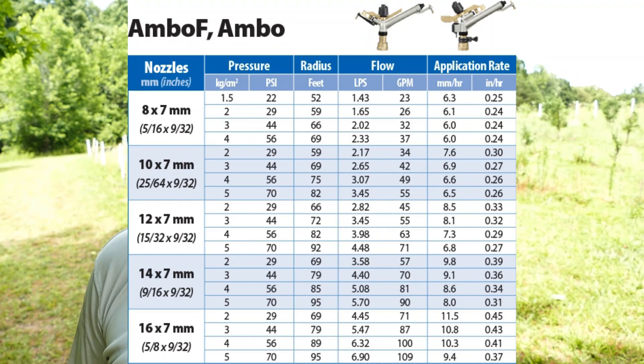I know somebody asked what kind of sprinkler head that was — I'll drop a link in this video's description. I think the company is Ambo, or maybe it's Syme and Ambo is the model. Anyway, it's a full circle sprinkler, inch and a half, and it comes with a couple different nozzles. There are a few different suppliers out there, but I ordered mine through Amazon and it actually shipped from Irrigation King, which has their own website. The pricing is pretty much the same no matter where you order. Looking at the specs published for this sprinkler, getting about a half an inch per hour is right around where we should expect given the pressure and the pump's capacity. I had gotten a slightly higher reading with my old pump, but it was on a much smaller circle. I think when it was operating under lower pressure, it was moving around its rotation slower, so it was able to drop more water in that smaller space than this one over the much larger space.